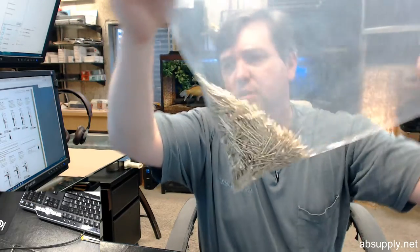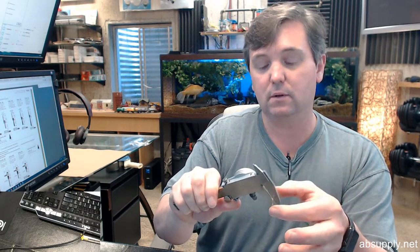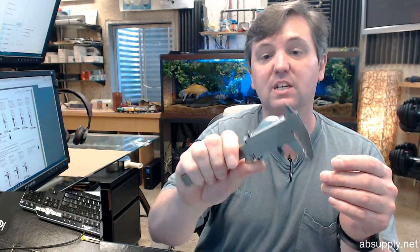This is a number 16 by 7 eighths nail. The 16 is a reference to the diameter, and looking up a number 16 wire size tells us that it is .0508 inch in diameter. I put the caliper on it — it's brass plated so I can't say for sure how much that would affect it, but the caliper says that this 16 nail is .063.